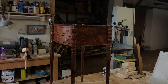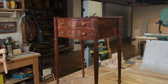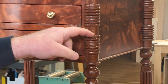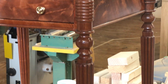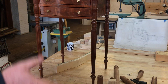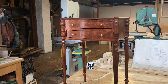It looks like a small, simple piece, but we've probably got somewhere in the neighborhood of 200 to 250 hours start to finish in making it. The finish involves several coats: first a sanding sealer, then shellac, and then some glazing on top of that — you can see dark spots in and around the beads and at the bottom, which is where the maid didn't clean the furniture too well. That shows a little bit of aging — you don't want a replica that's all shiny and brand new; you want a little patina and a little defect in there to make it look older.